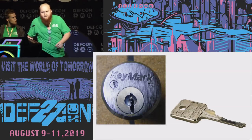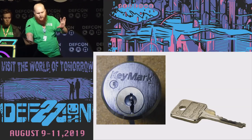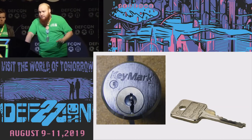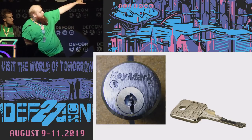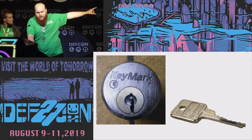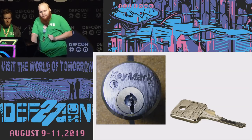Let's talk about KeyMark. It's sort of a compromise solution by Medeco that has ostensibly restricted keyways, but none of the high security Medeco angle cuts. If you take a look at this picture here, you can see that the pins in the KeyMark lock only go into that nice, straight, flat part at the top. That nasty keyway at the bottom never actually interacts with those pins.